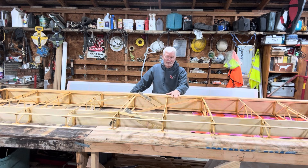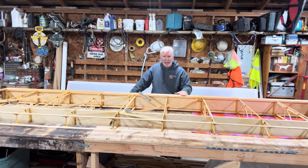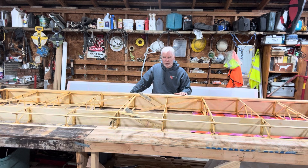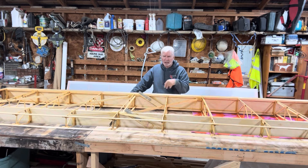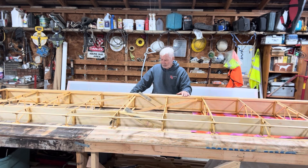The fabric brought up to 350 degrees for the final stretch, wiping down with MEK to get all the smooth and unsmoothed edges off, and then covering with poly brush — a brush-on coat and then a spray-on coat. I'm gonna do all of them at the same time, wait until they're all done before I start spraying, make it an assembly line.